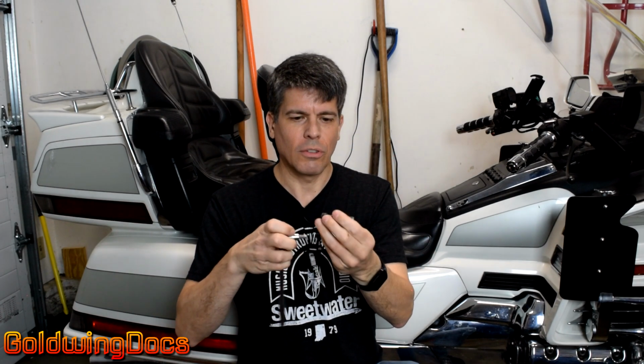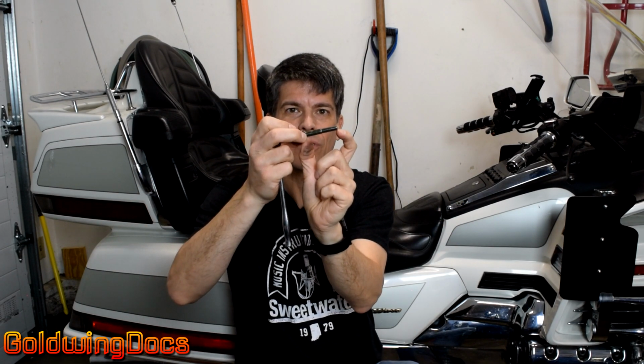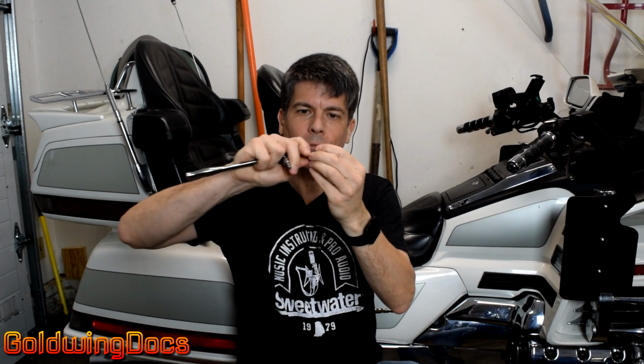Steel fasteners, such as this screw right here, this machine screw, when the head contacts the surface of what you're screwing it into, you can continue torquing it, and what you're actually doing is stretching the fastener itself. And it's the elasticity of the steel, that stretch, that's what's holding things tight, and that's why you can get it so tight that it actually holds things in place. And the tightness of that fastener against the threads and the head against the surface causes friction. And that friction is what keeps the fastener from backing out.